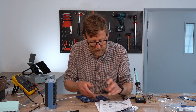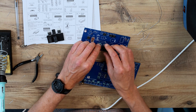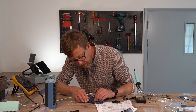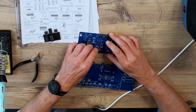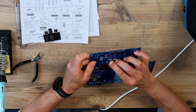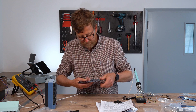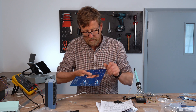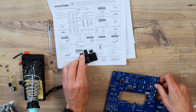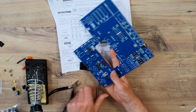Similar story here. I think we have to solder this one straight in. There's an orientation to this one as well, which is clearly marked on the body of the device. Just a bit of a push to put in. There we go — just make sure all the pins are in nicely there. I'll put the other one in. Just double-check you've got the orientation right.